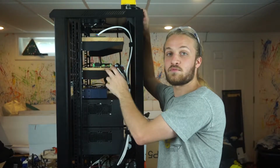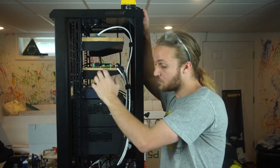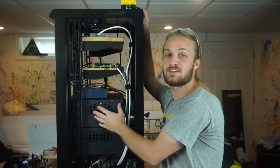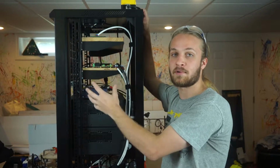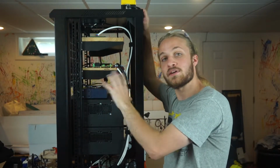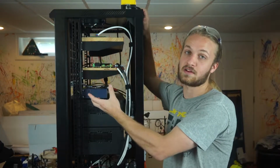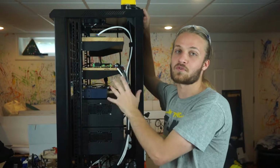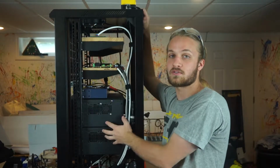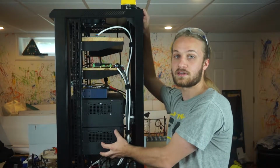Next here we have the relays that control the solenoid outputs. Each one of those also connects to an AddLink digital output card through an opto-isolation and a buffer, which gives us a safe way to control our solenoid outputs, especially the 120 volt solenoid outputs where we don't want any possible short or anything to damage all of our control electronics. And then of course we have the data acquisition computer and the video computer down here.